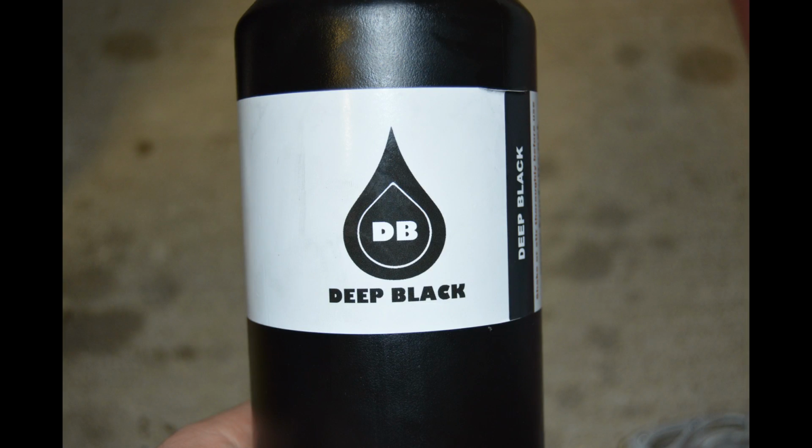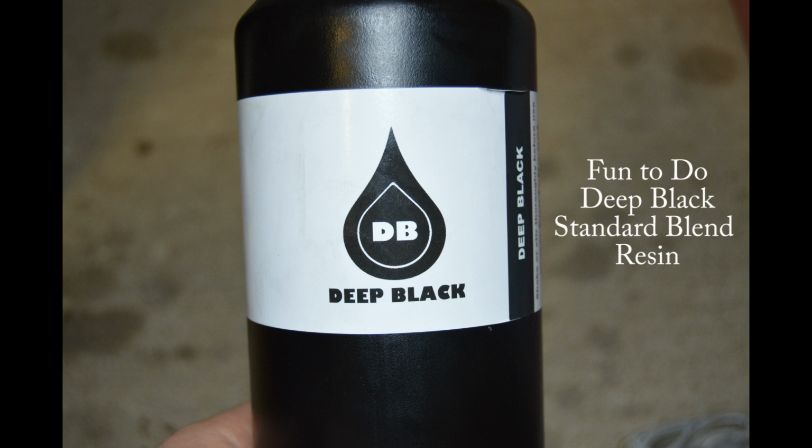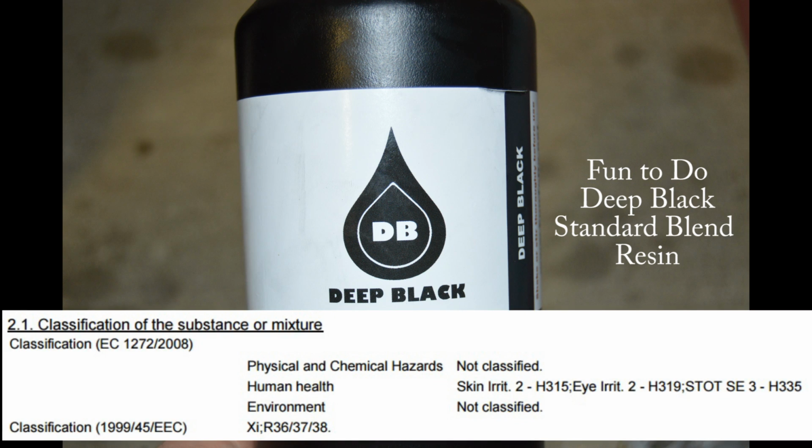Photopolymer resin is used on these types of printers. This is resin that is sensitive to light, in particular ultraviolet light. This resin cures into hard plastic when exposed to ultraviolet light and is a powerful solvent. Because of this, resin is not the same as the ABS plastic used in typical fused deposition modeling printers, and is not suitable for parts that will come in contact with food, or for children's toys, or anything that would spend prolonged contact with the skin, as it may cause irritation.